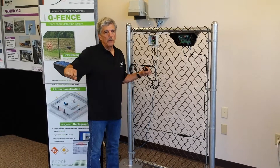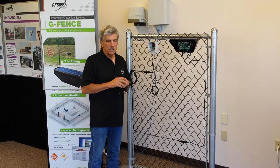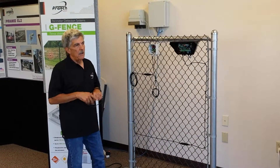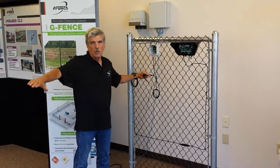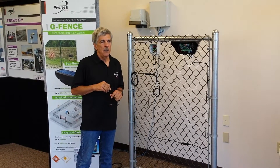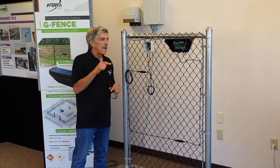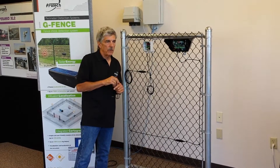This control unit enables you to adjust a roll of sensors. The sensors come 40 to a 100-meter roll, and when you install them on a fence line every 10 feet — with a panel, say, 10 feet wide and 12 feet high — you're able to adjust the sensitivity and the number of impacts on the entire roll of cable. Or, if part of that fence was in not as good a condition — older, with a looser fabric — you can dial in a specific sensor and adjust it to a lower sensitivity and a higher number of impacts.